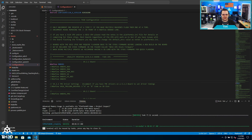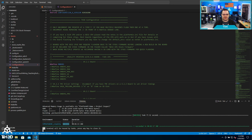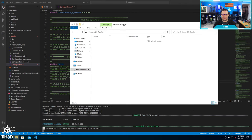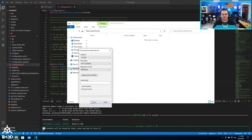Now you can see the firmware successfully built. You can see a success status at the bottom. If there are any errors, they'll show up if you scroll up in the output window. For the stock configurations, you're rarely ever going to get any errors. I've put my SD card into my computer — I'm going to format it with FAT32 format with a 4096 allocation unit size.